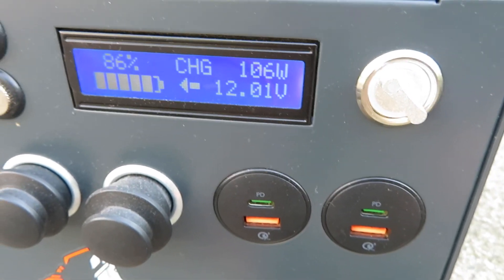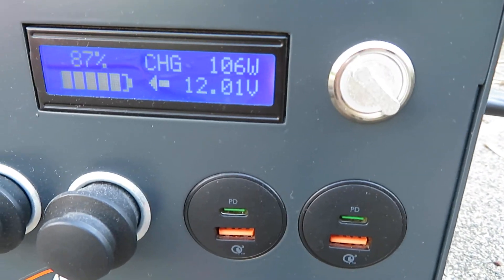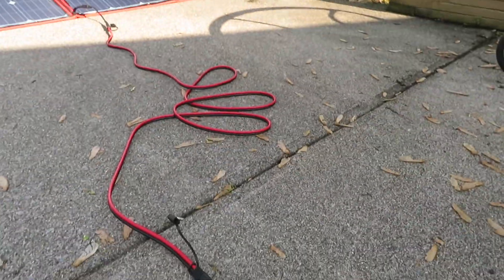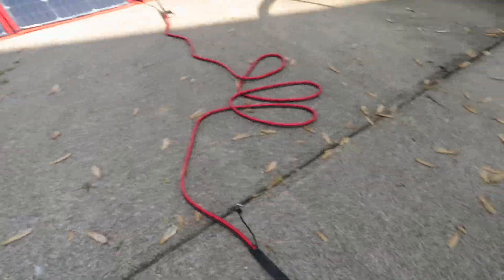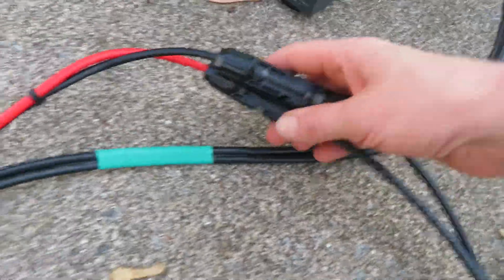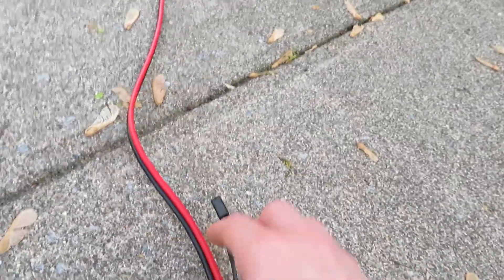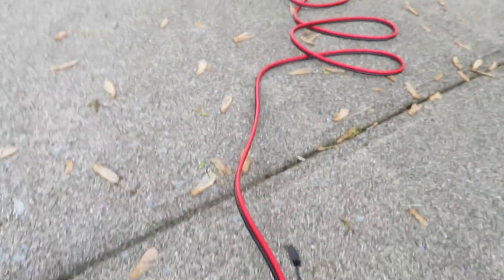It's kind of hazy today and I'm sure I don't have the angle right, but I am getting a charge. None of these panels are going to draw in as much power as they claim. This 300-watt panel will never actually draw in 300 watts — that's true of every solar panel. And because I had to use an adapter cable, I'm already breaking the power line there, making it worse. Adding the extension cable gives me even more loss.